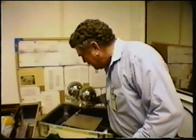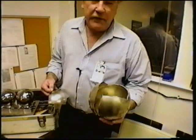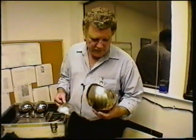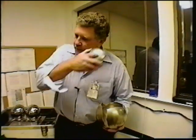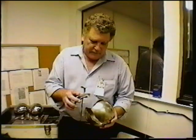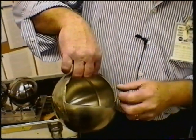This is a titanium vessel that has been proof tested with hydrostatic water, taken up to whatever the design pressure was, which was quite high. The safety factor whenever you fly anything is usually around 10% on flying hardware, 5% on military hardware, and on our hardware I think it was around 10 to 15%. It's supposed to blow exactly when they calculate, and this pretty much did — I think it burst at 8,000 PSI or something like that. We had to switch from titanium to aluminum because titanium formed hydrides inside with hydrogen in contact with it. When the hydrides form, free hydrogen can begin to form inside the metal and blister it and destroy it by explosive badness.